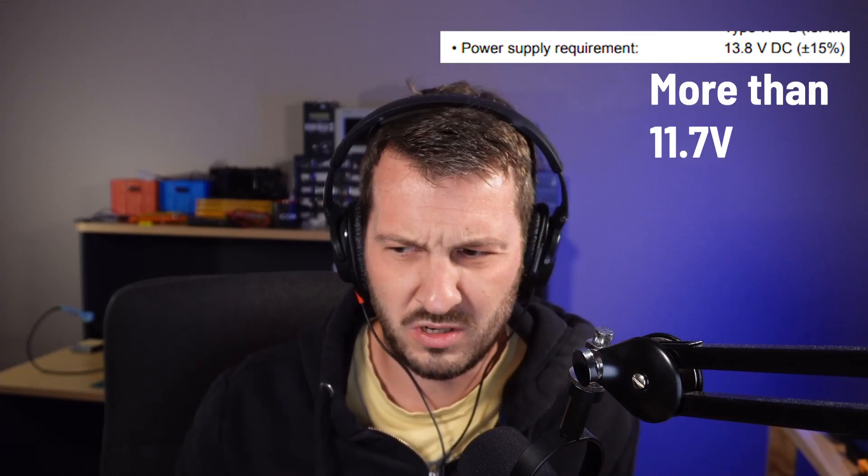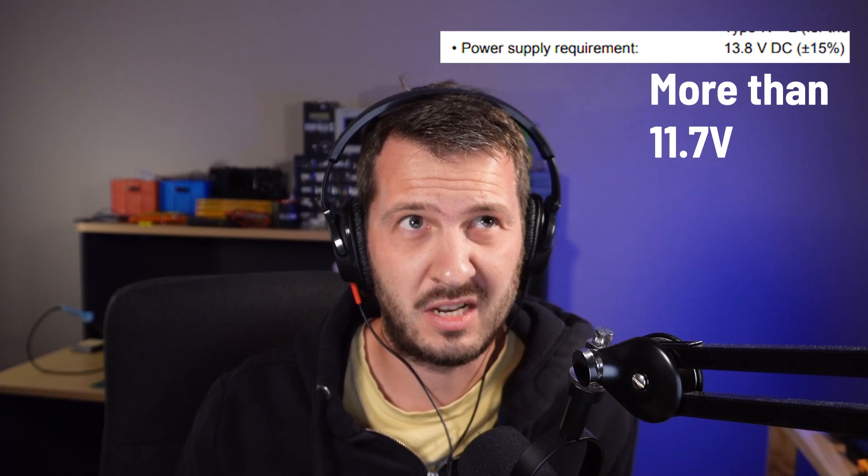Another thing you can do is plug a multimeter into the power supply and have a look at the voltage. Most power supplies are regulated voltage power supplies, which means the voltage coming out stays the same no matter how much current is being drawn. If it's an unregulated power supply, or one that cannot deliver the continuous current the radio needs, then you'll see that voltage sag — and if it gets below around 10 or 11 volts, the radio will switch itself off.